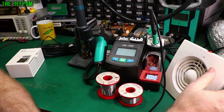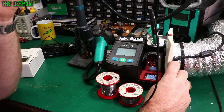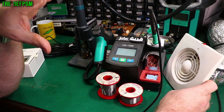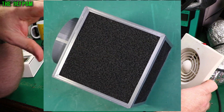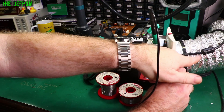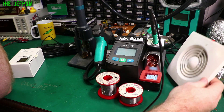Over here you can see a home-built DIY fume extractor. This is literally a wall-mounted extractor fan, and I've got some ducting on here which runs down the back of the desk. On the other end of that is a filter box which I made — I did a video all about it, so I'll put a link below. That filter box you can make yourself — it's just 3D printed. I got the files on Thingiverse, so you can download those files, print your own box for the filters, and make yourself a simple fume extractor system. This is 100mm ducting. I modified it by making the top switchable so I can turn everything on and off from there. Nice and easy, super convenient.